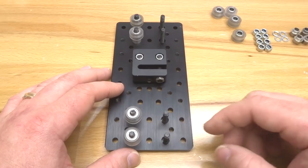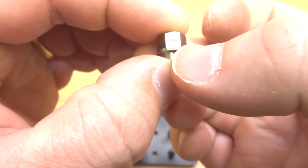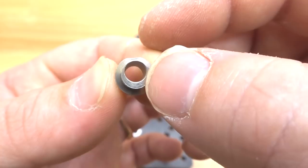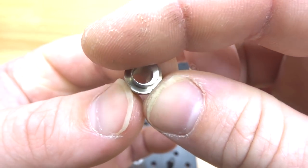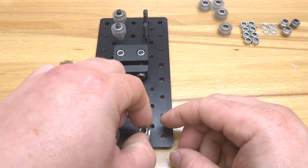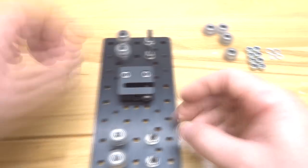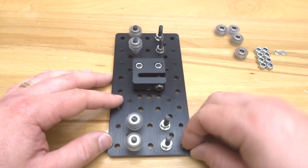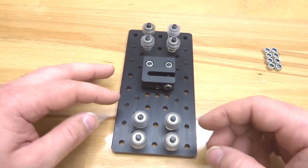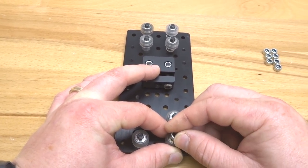Now moving to the eccentric side — make sure the eccentric is fully open. You'll see a 6mm stamp indicating the fully open position. The eccentric works like a cam with an offset center, allowing tightening to the track. Leave it in a fully open position facing away from the fixed wheels. Do the same for the additional screws, add mini V precision shims, then mini V extreme wheels. Cap all wheels with nylon hex nuts, threading them on top of each screw.